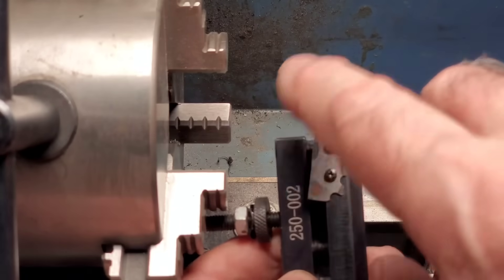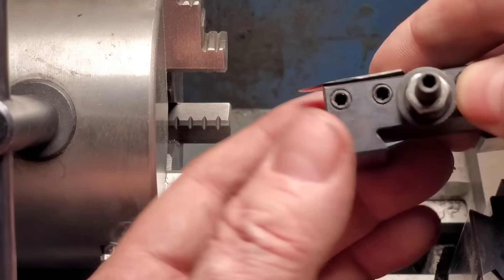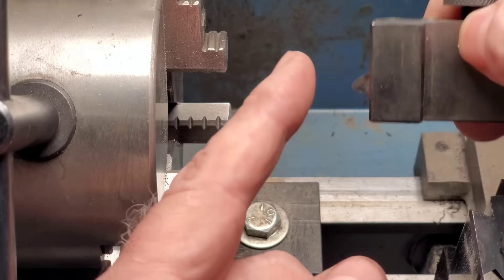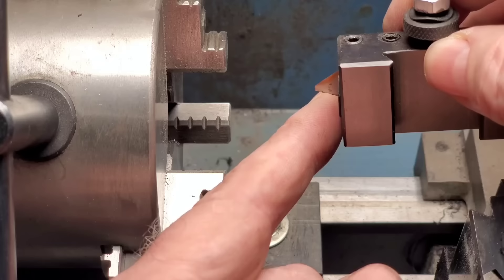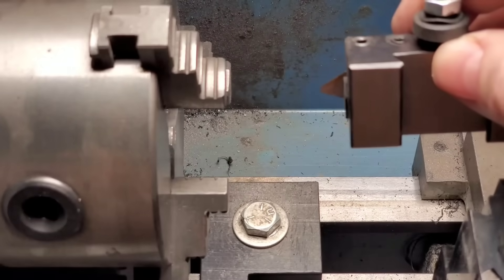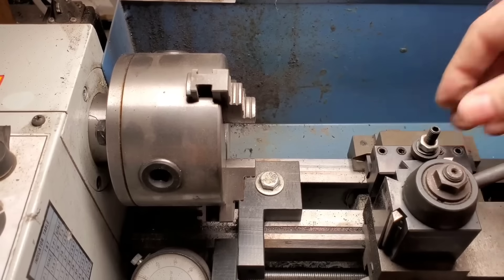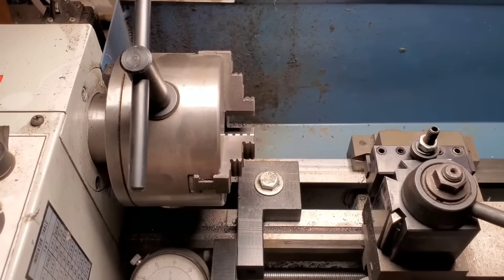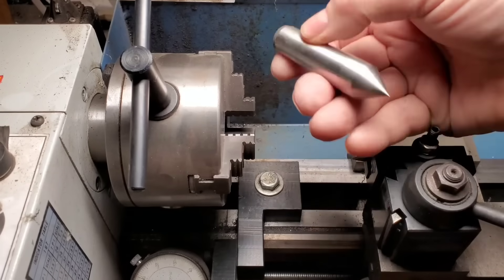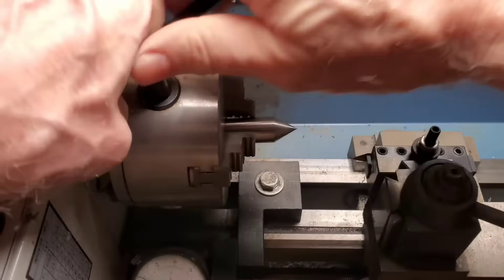You've got a good tapered point, and you also want to angle it in such a way that the cutting edge goes straight into the rubber. You don't want it angled this way or that way. You want your razor to go in with your cutting edge on the bottom, and the chuck will be rotating clockwise. We'll mount this onto the tool post. You'll need to use a live center or a center drill, something with a nice sharp point, and tuck this up into the lathe first and get it good and tight.